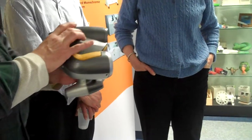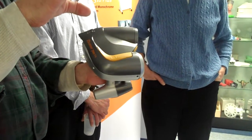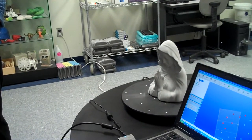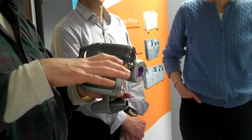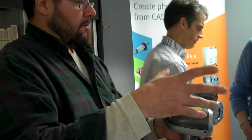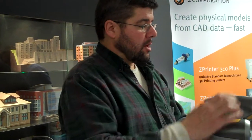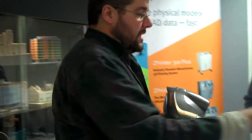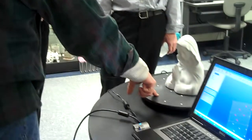This is our PX, which incorporates photogrammetry. Photogrammetry would be a series of digital images taken of a positional model with the targets, but also a bunch of coded markers. The coded markers are reflective, with a 6mm target in the center and then a unique pattern around it. You snap a bunch of pictures with the center camera, and the software captures those images of the coded and uncoded markers. From the coded markers, it knows the position of the camera when you took the pictures — how far away you were and at what angle — because it needs to locate the center of those. The more accurately you can locate the X, Y, and Z value of the center of that target, the more accurate the positional model and the more accurate your scan.